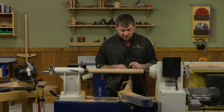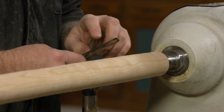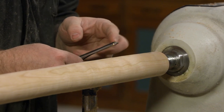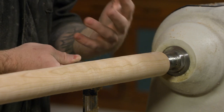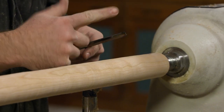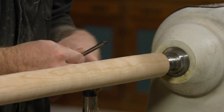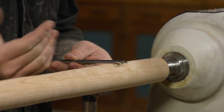What I've done is made that flat on the back and I also usually will come in and grind the sides a little bit. That's just to bring the entire profile in, and that allows me to get a series of beads closer to one another rather than leaving them kind of flared out. This is basically going to cut like a scraper.